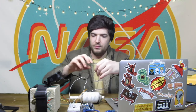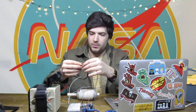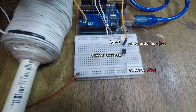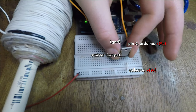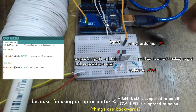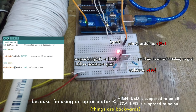You saw what happened when we hooked a BJT up to this big coil of wire — let's see what happens with a MOSFET. This one goes gate, drain, source from left to right. I'm setting it up just like last time: the collector of the opto isolator gets 9 volts, the emitter goes to the gate — which is the equivalent of the base on a BJT. I just put an LED there to test it. I need a pull-down resistor — that's visual evidence of why you need one. Let's turn it to high — turns back on, wonderful.